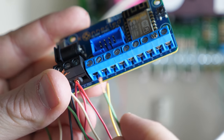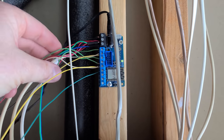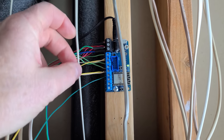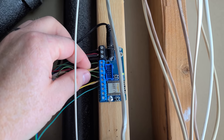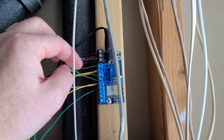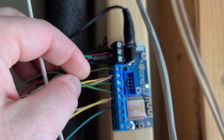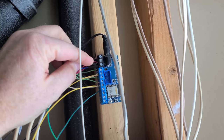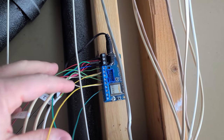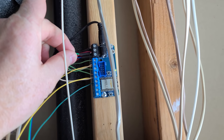To connect the wires to the panel, just place them into where they belong and then screw the flathead screw on top until it is tight. Proceed until you have all your zones placed. For my system, the red and black are aux power, the green is the zone wire, and the yellow or white-beige is for the ground. So zone one has green in zone one, then there are two grounds for zone one and two. For the alarm, I used the jumper cable — the green goes into the red auxiliary plus, and the blue wire goes into the alarm terminal.